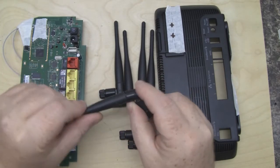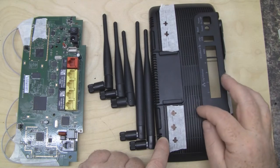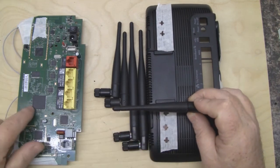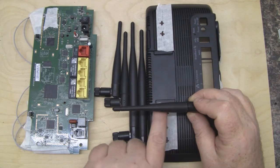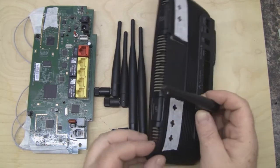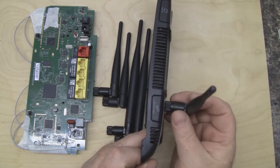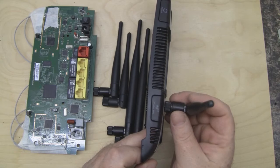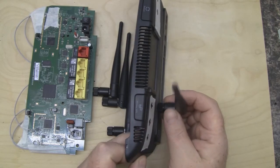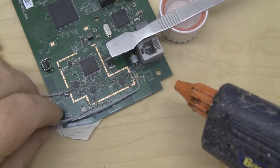I've done a separate video on that modification — link is below. I didn't want the connectors positioned too low, because if the antenna is down near the PCB, the PCB itself will act as a reflector and a large part of the antenna signal will get blocked. Any signals from that direction will be obstructed, so you want a nice clean signal 360 degrees all the way around the router. I've now drilled the holes and I'm getting ready to put it back together.